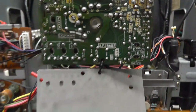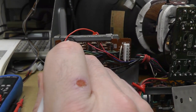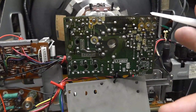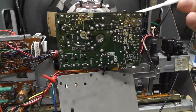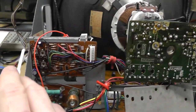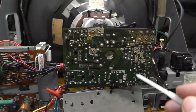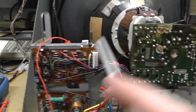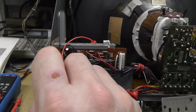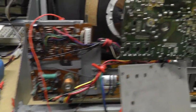And with that, we can set our B plus voltage with the brightness all the way turned up, without having so much voltage going onto our color lines that these resistors right here start getting really hot, though I'm not positive about that. So I feel like you need to set your screen and all your RGBs fully counterclockwise, then set your B plus voltage with your screen pot turned all the way up. And I'm just going to show you the voltage of that real quick.